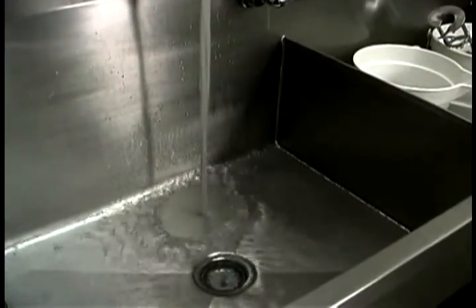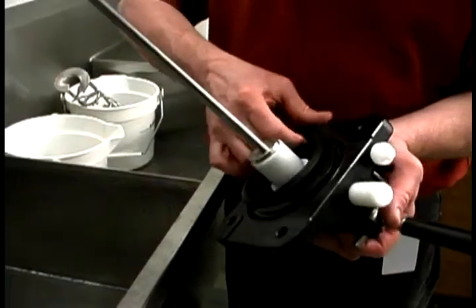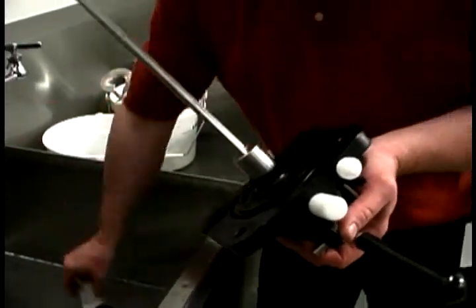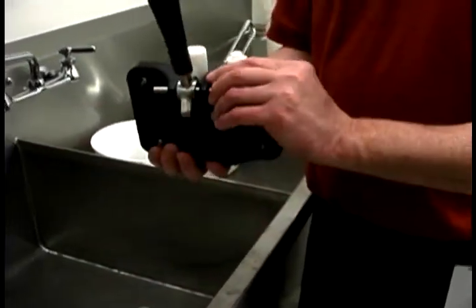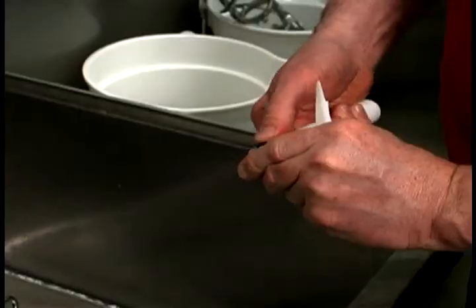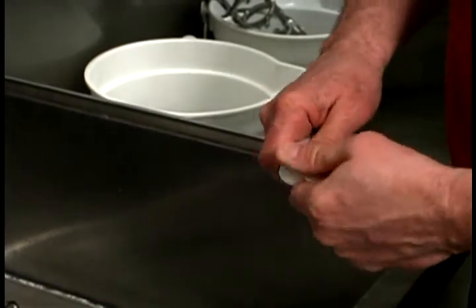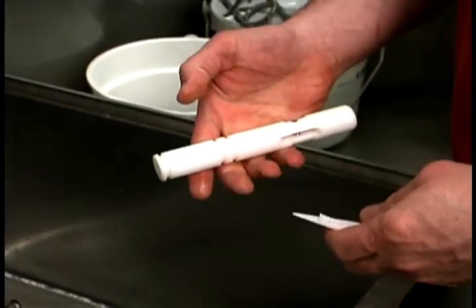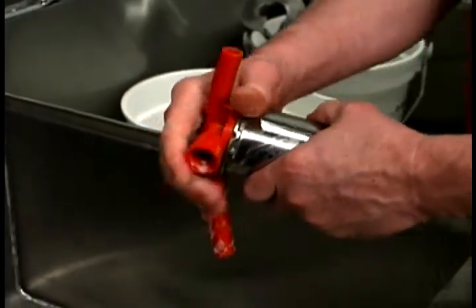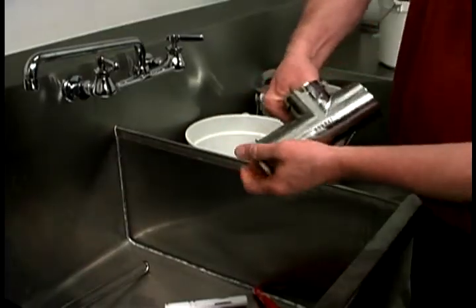At the sink, remove the seal from the drive shaft. From the freezer door, remove the gasket, the front bearing, the pivot pin, the adjustable draw handle, the draw valve, and the prime plug. Remove all O-rings using an O-ring removal tool — apply upward pressure until the O-ring pops out of its groove. From the pump cylinder, remove the retaining pin, the mix inlet adapter, the valve cap, and the piston.